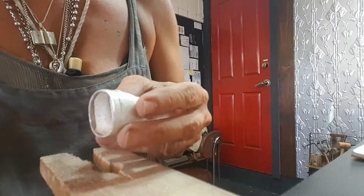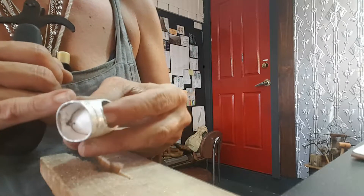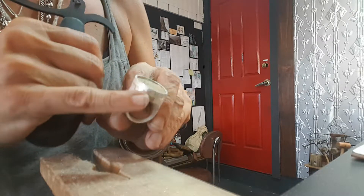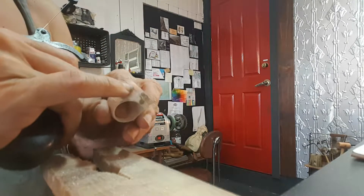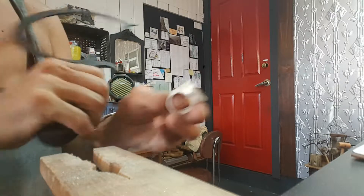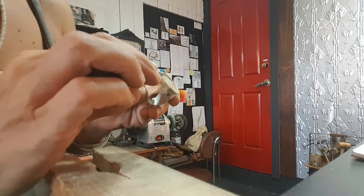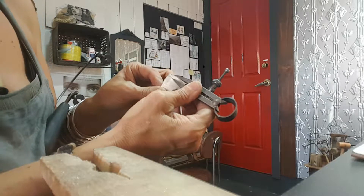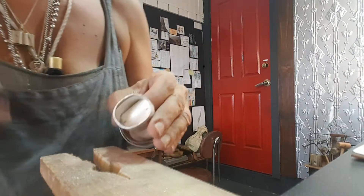I just wanted to show you guys how to cut around a curved shape. Here I'm trimming this ring because I decided it was too long — the height was too high — so I need to shave this much metal off the whole ring. I've scribed it first with a scriber, working my way around until you get a nice line.